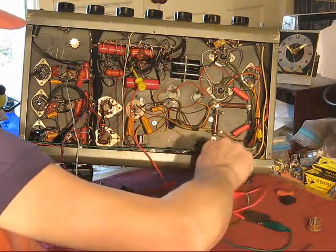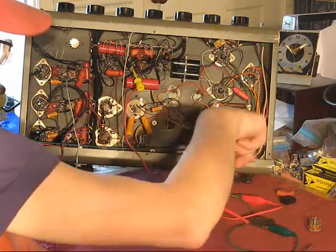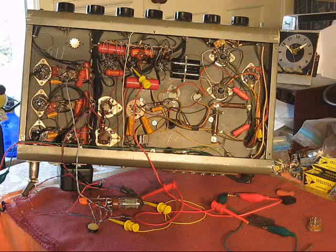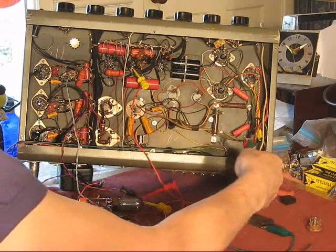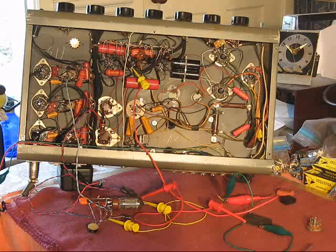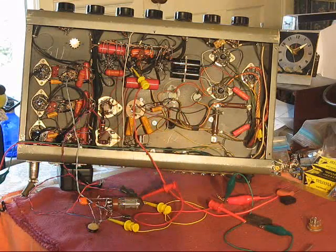Yeah, that's pretty full depth modulation. I'm going to insert 47K resistors in series with this tap and this capacitor. And it definitely lessens the depth of modulation. So, simple matter to just put a pot in place of this. Pick a value that when it's set to maximum resistance, modulation is either gone or not noticeable. And the minimum resistance gives you the full Monty.